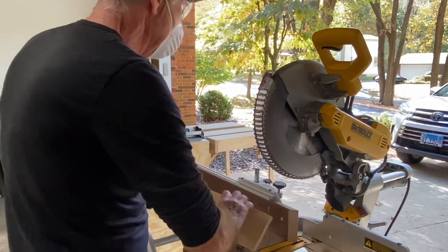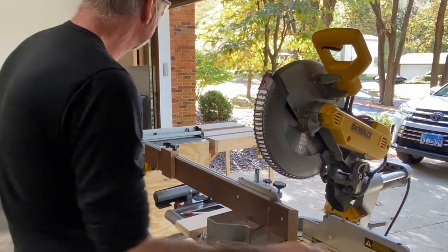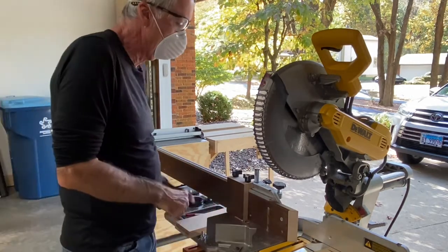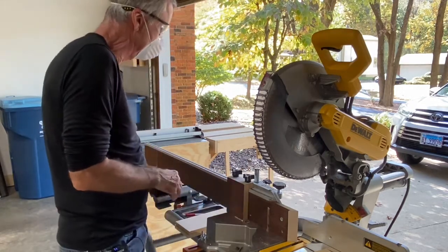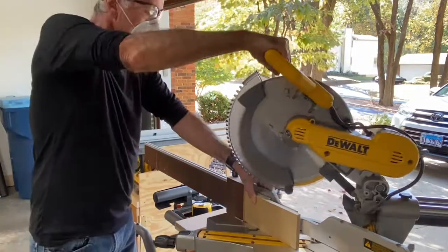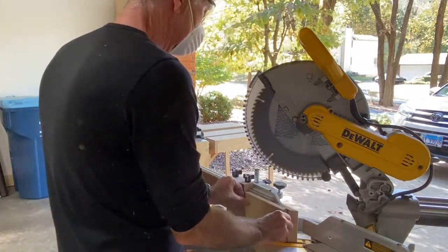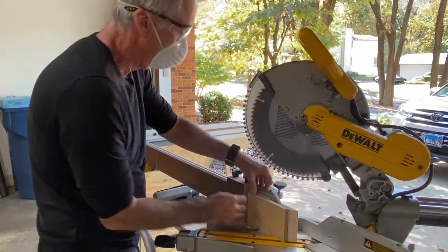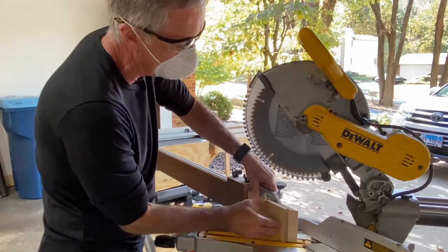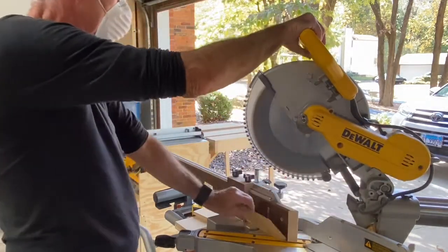We'll set these aside for the moment and then set our stop block — we want to be eleven inches or eight inches when I cut this off. I've measured now and set my stop block such that it will be eight inches from my blade and we'll make these first two cuts. You'll see how quickly I can make these 45-degree angles. Just make sure that you get your angles set up the right way. Once you have your first cut so your distance is eight inches, then all you want to do is come back and cut this angle at a nice 45 and your saw is already set up to do that. So there's my first side.